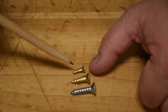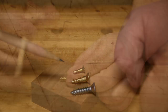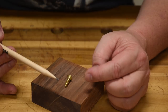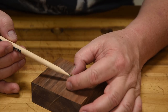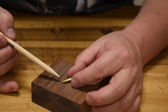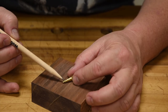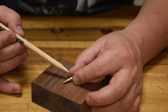These are designed to be used when you pre-drill a hole a special way. When you use brass, you're going to have to drill two holes, and generally you're joining two pieces of wood together. So one hole will be in one board, the other in the second board. The first hole is the exact thickness of the shank on top - it can't be any smaller because that will cause resistance and might cause the screw to snap. The second one is going to be the thickness of the medium-sized center section, not the very tip. The tip will just guide the screw in straight, and this will draw one board down into the other.